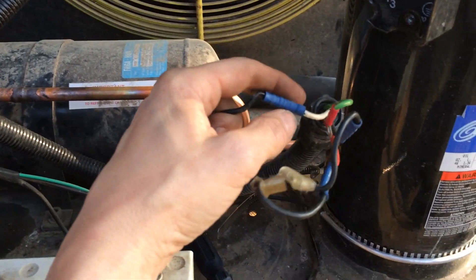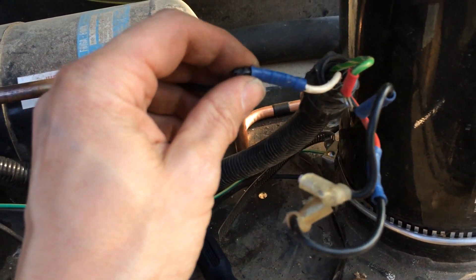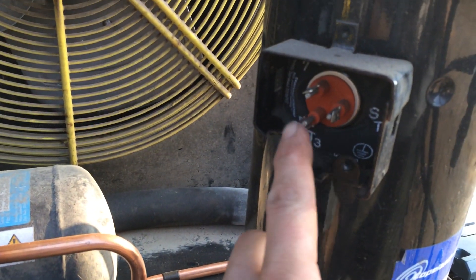The one on the other unit, they hadn't quite crimped the wiring enough when they crimped it. There's a bit of copper showing and they had a bit of tape around that one as well. So we'll sort this out before we put the terminals back on here.